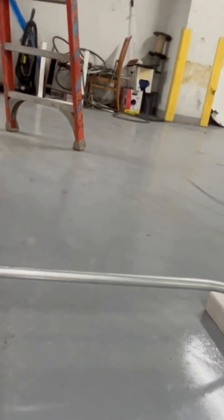This is multiple bends in one full length — can do it. An iron, two offsets: this is a five and a half offset, 14 and three quarter offset, and this is a 30-degree kick — not a big deal — which is gonna go up there. To finish the run, the complete run of the conduit coming up there, I'm going to end with a kick to come down, a 90 and a 30-degree kick, again an offset, a coupling, and I have a three-foot piece to complete my run.